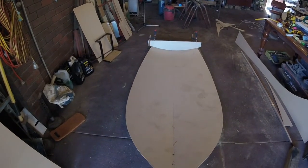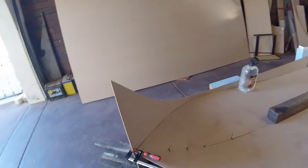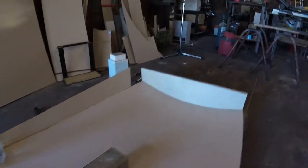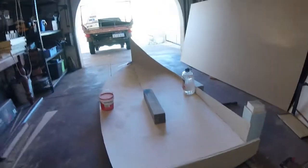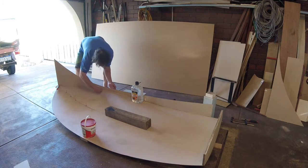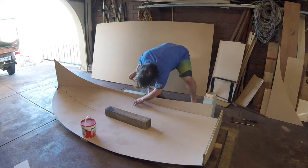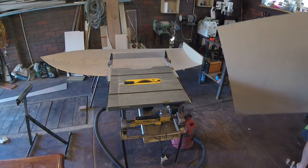We'll fix that transom curve on to the boat and then talk about marking out the sides. What I did was support the bottom with little blocks of wood everywhere and a measuring tape on the floor to make sure it's roughly symmetrical. I put a big block in the middle to hold the center section flat — that's where the seat will support it — and a little block under the transom to give it a little bit of front-to-back curve. Then I supported this bit of scrap with anything in the workshop — a bit of railway line and some old bits of veranda post — and marked the curve for the side of the boat.